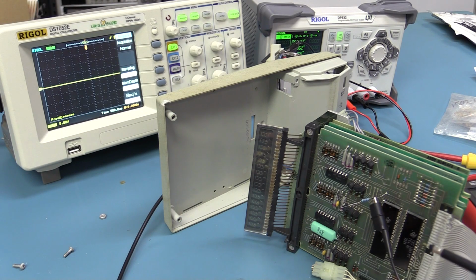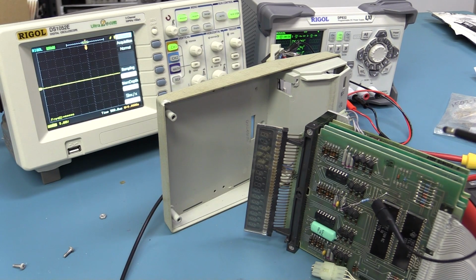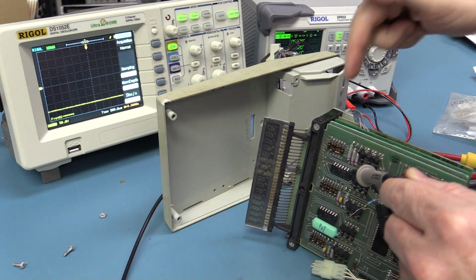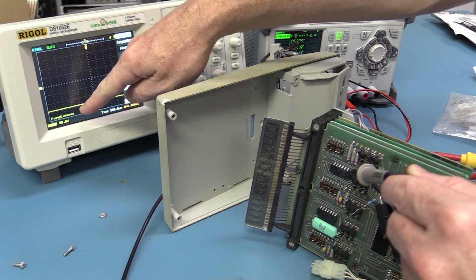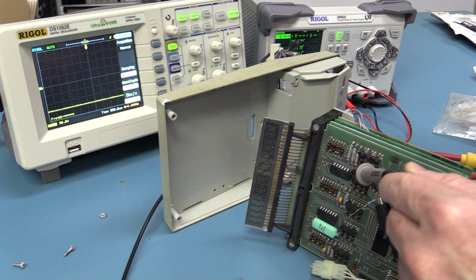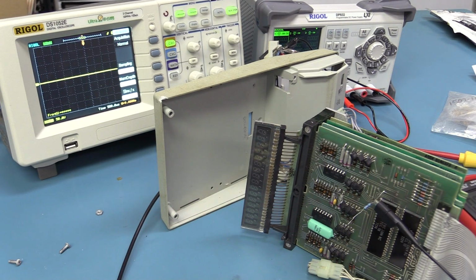But we're getting nothing on the display, and I presume that I don't have to do some sequence to power the damn thing up. So I don't know. I would have expected the display just to come on, but certainly getting some activity there. And some of those pins on that chip there, negative 150 volts. That's 50 volts per division. So yeah, serious business. Unfortunately, I think I'm going to have to call it quits there for today.